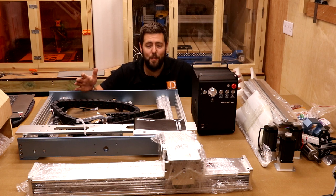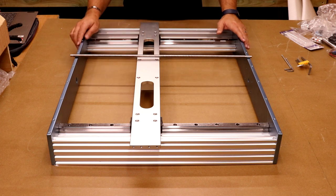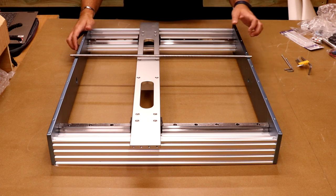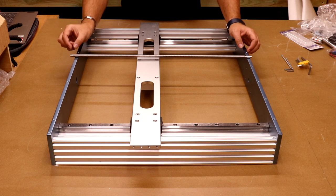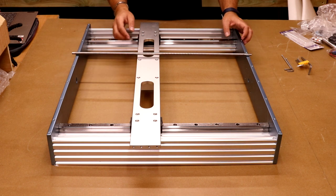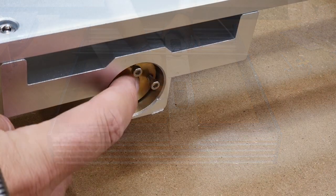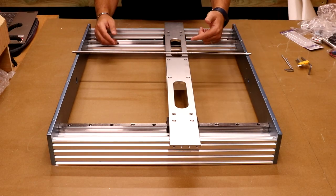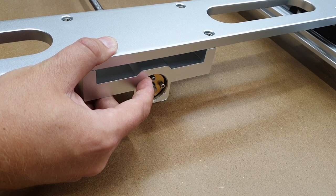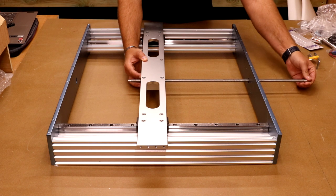When all that is done, we can dive in and start assembling. Pre-checks are complete and the first thing we want to do is install the Y-axis lead screw. There is a front and a back to the frame — the front has the Genmitsu writing on it, the back has extra holes where the Y-axis stepper motor will go. The lead screw also has a front and a back: the front has the shorter machined section, the back has the longer machined section and a flat piece machined out of it. Feed this through from the back, through the carriage to the front. On the carriage there is a spring-loaded backlash nut, so as you feed the lead screw through and turn it, apply pressure to the backlash nut to ensure it is pressing against the lead screw itself.